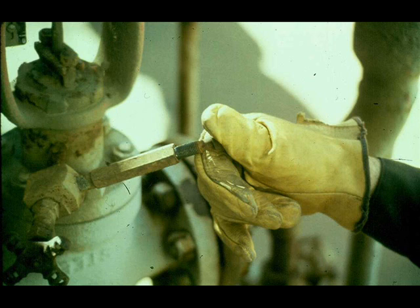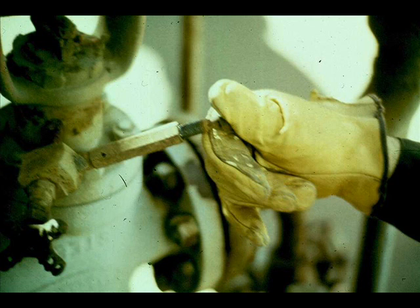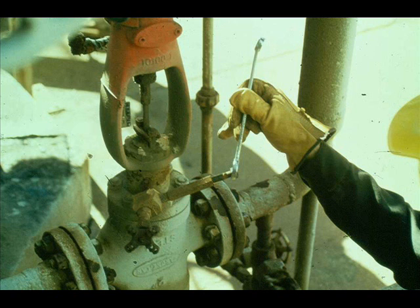A small leak can usually be stopped by putting lubrication into the valve packing. Close the lubricator valve. Remove the bolt. Install the lubricant. Reinstall the bolt and turn it five or six revolutions. Open the valve. Force the lubrication into the packing by turning the bolt.